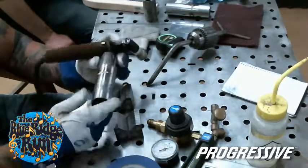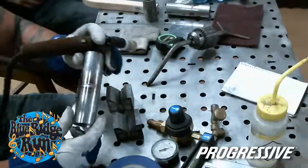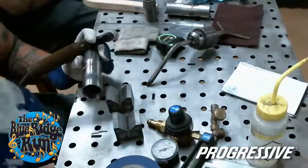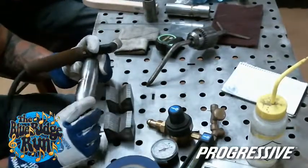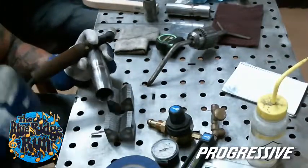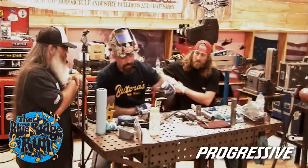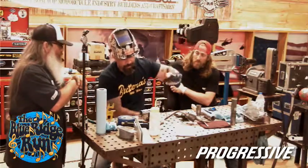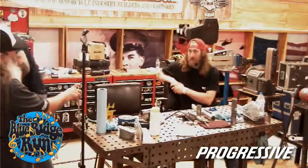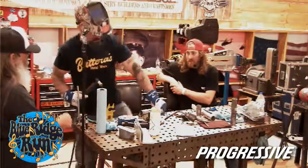If it was a properly purged weld, you'd have that pressure behind it. I don't know if you can see, you have quite an indentation there. And that's where the rod comes in and you fill that in. The purge would hold that out. You wouldn't have that, you would still see a little bit. You could eliminate it in different ways, but you still may see a little bit. I could come off with the heat. I'll do one trying to back off a little bit. And that's the thing too. It's feeling out the machine, the response of the foot pedal, how quick it develops the arc and gets the metal melting. They're all different.